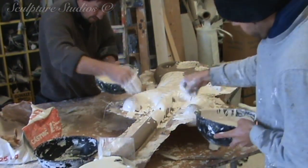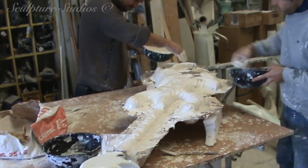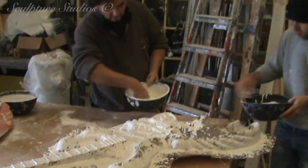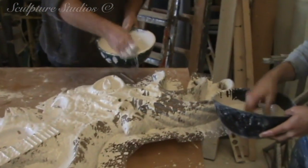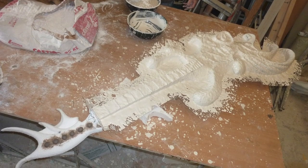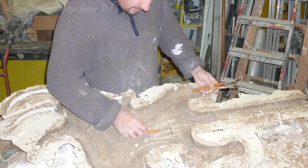This means you'll only really get one cast from it, as the plaster of Paris is only strong enough for one cast pull. We've created a dividing wall around the perimeter of the guitar, and this allows the mould to split into two pieces. Starting with a more watery layer of plaster to achieve all of the detail, we gradually build up in a few thicker layers on top. Once this process is repeated on the other side, the plaster is then left to dry out properly over the next couple of days. Leaving it to dry like this helps reduce the risk of the plaster cracking through being too damp and too soft.